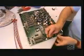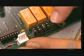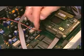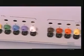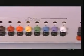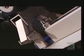of the base. The robot controller, the brain that runs the arm, is a separate unit. It controls everything connected to the circuit. To move the robot, the computer inside the controller switches on all the necessary motors. It can control 8 motors, 6 in the robot, and 2 optional accessories. You can program it to perform a variety of tasks.